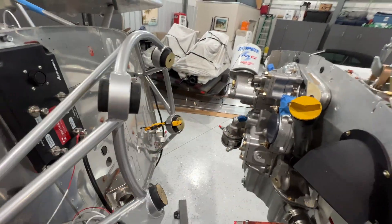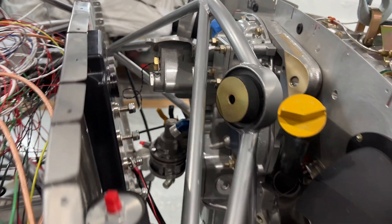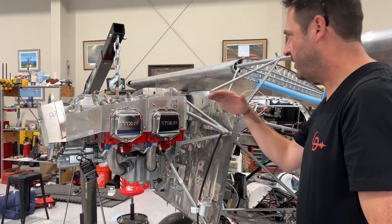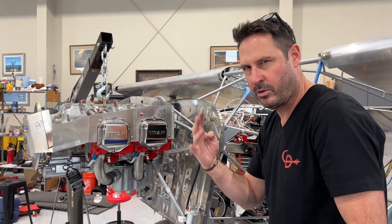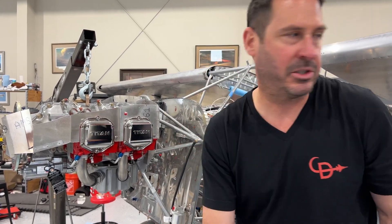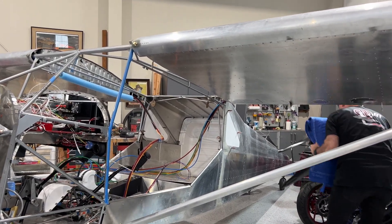We've decided to take off the oil filter because it just requires too much duck, dip, dive, and dodge. Removing the oil filter was the money play — seems obvious now, as most stuff does. We've sourced the parts — the big 7/16 bolts. The engine is level but the airplane is not, making it challenging to get all four holes lined up. A better solution is to just raise the tail and make the airplane level.